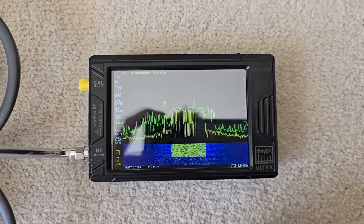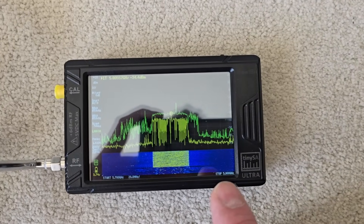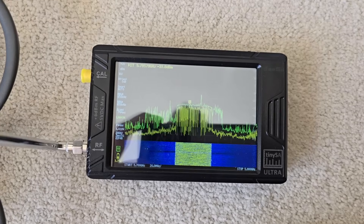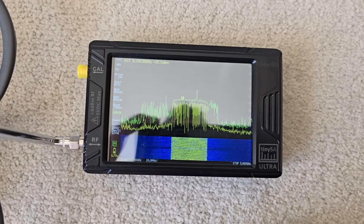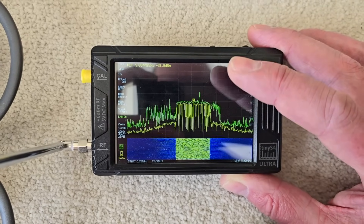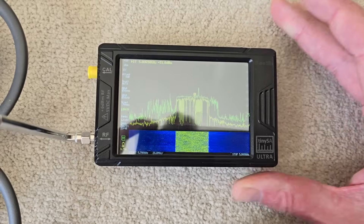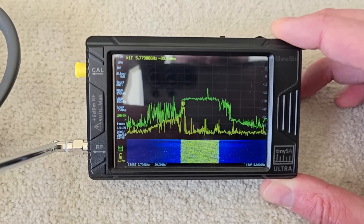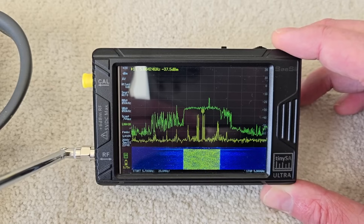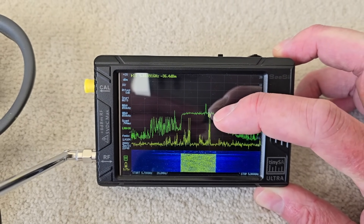Bandwidth — you can work that out. We're at around 5.7 GHz here, going up to 5.8, 5.9. You can see it's using a good chunk of spectrum. The height of this reading, going vertically, is actually the signal strength. If we turn the drone off, you can see it hangs for a little while and then drops back down to pretty much nothing. But we've got a hold level here, so you can see how high that is on that line.